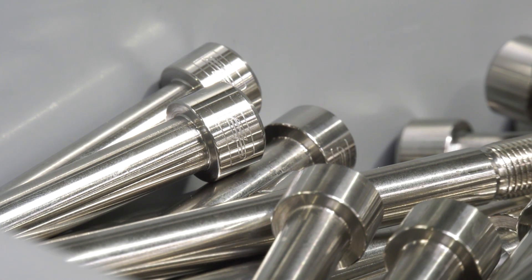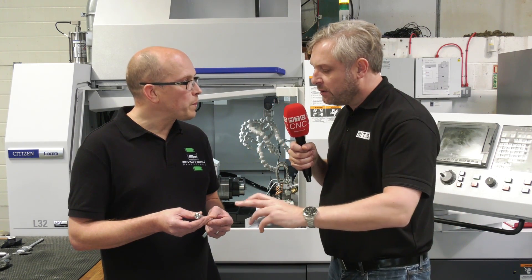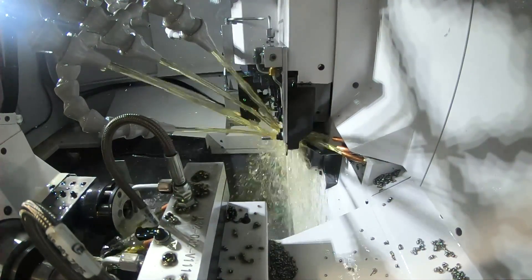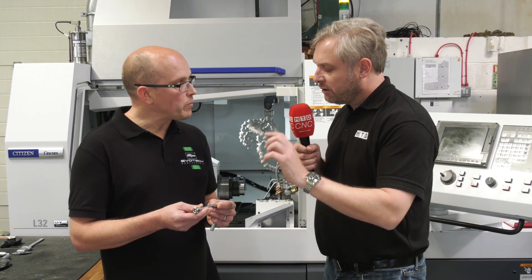One thing the machine gave us that we never had previously was the ability to etch our logo on the actual bolt heads — not an absolute necessity but it raises the perceived quality aesthetically. On the two-pass process, you turn the part that needs roll-threading, then re-engage the shank at the point where you left off and carry the cut on — there's no mismatch issue at all; when it re-engages the part it is perfect. And thread rolling on this machine works a treat — I wasn't aware you could do it on a sliding head rather than a separate thread-rolling machine.